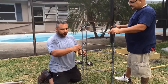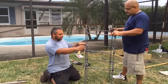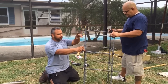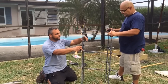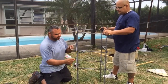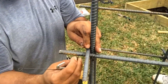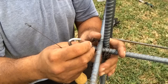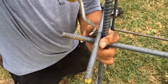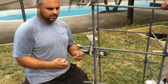So we're working on the rebar frame that's going to go inside the hole. It's about four feet tall, and then we used two-foot-long rebar across the sides, and we've got these wire ties here. We're just going to wrap the tie around and use this trusty tool here — you pull while you spin around, and it's going to lock it into place.